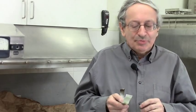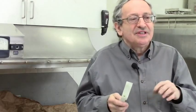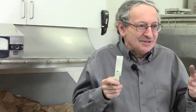The second reason you can't is if the sheet metal is very, very thin. Because any metal thinner than, say, half a millimeter, if you sandblast, will completely distort. The reason is the sandblasting is like shot peening. It will put in compressive stress on one side and the piece will immediately bend. If you flip it over and sandblast the other side, it will straighten out, but never perfectly. So if something is made of very thin material, you cannot sandblast it without distorting it.